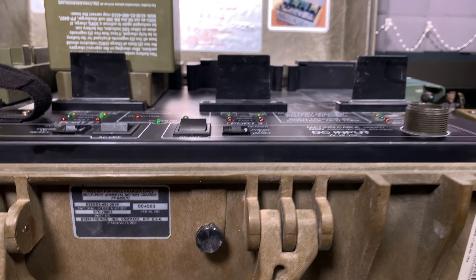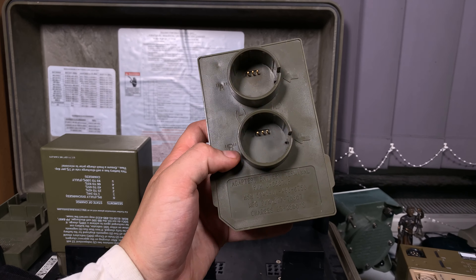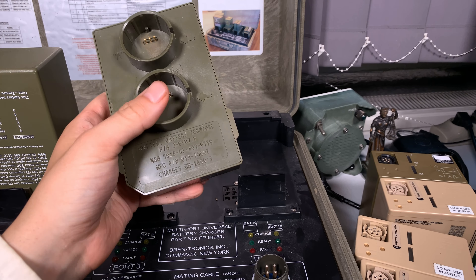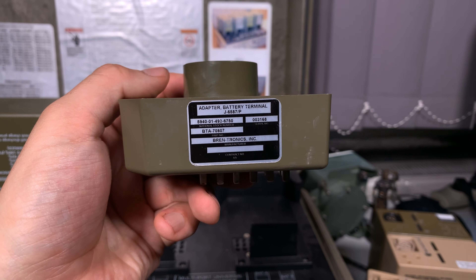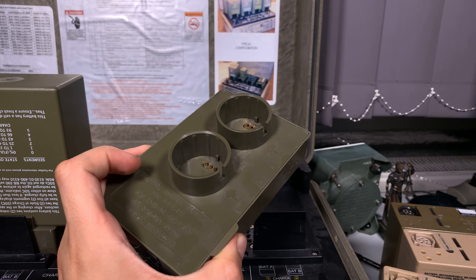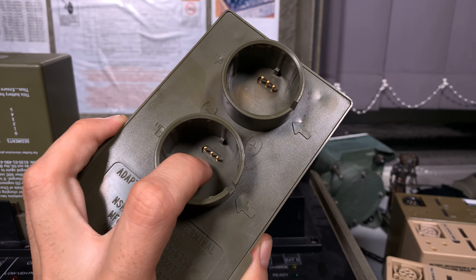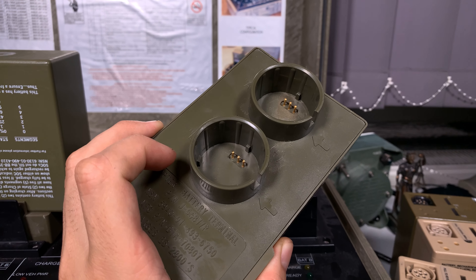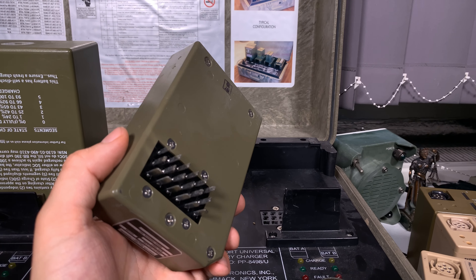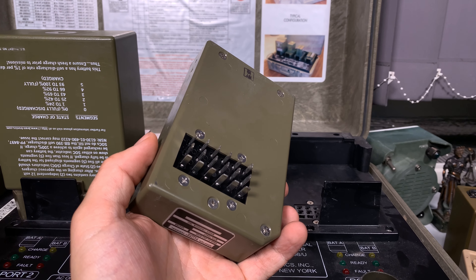That's the full name. Why is this a universal battery charger? This is a battery adapter, and you can fit this battery adapter into that tray. The idea is that you purchase an adapter for the batteries you are actually using. This adapter has pins and a form factor for the battery you are going to recharge, and those pins are routed to the charger along with control pins that tell the battery charger what kind of battery is plugged in, what voltage, and other things.